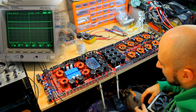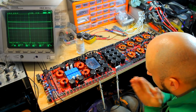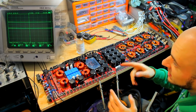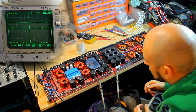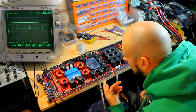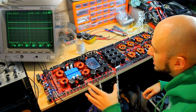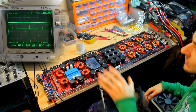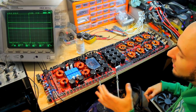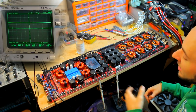low side drive. I'll probe the low side drive, which is going to be on one of these legs. And I hate moving the probes when there's still almost 90 volts sitting there. So I'm going to wait for this to come down again, move the probes around, and probe the low side drive wave to the low side of FETs on the outputs, and zoom in on the scope so we can see what the low side drive wave looks like, which is a very good indicator of how healthy the drive circuit is and how well it's powering these outputs.